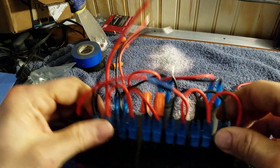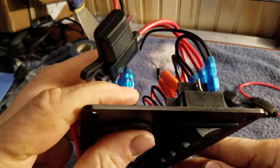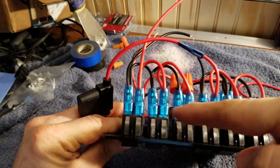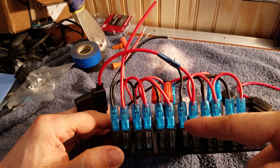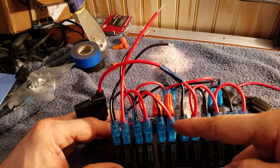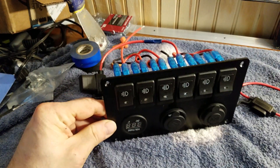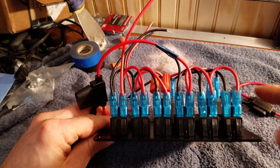These three switches here — we've divided these in half. You can see on here: 35 amps. Each of these switches is rated for 35 amps. So what we've done is separate three and three. If you wanted to, you could separate every single one individually — cut it, put a fuse in it, or run it to a fuse box. What I'm actually going to do is run these to a fuse box, that way all your fuses are in one central location.